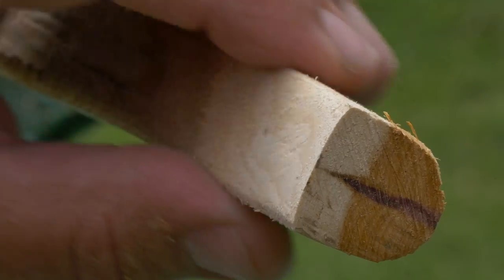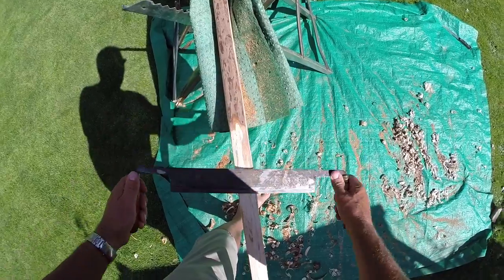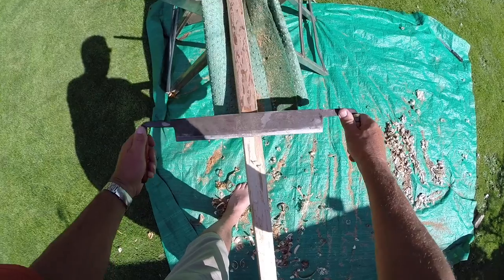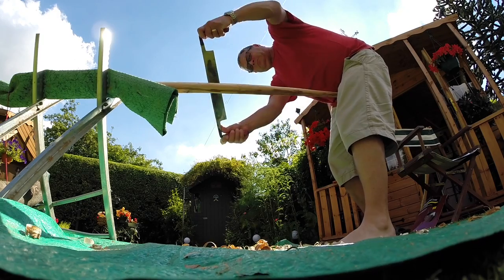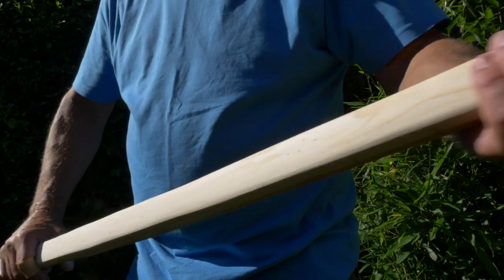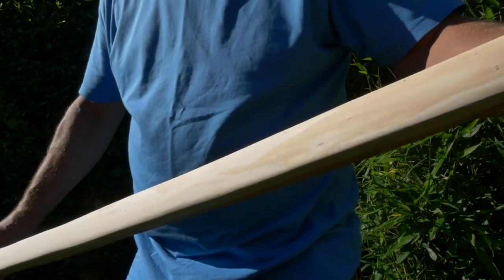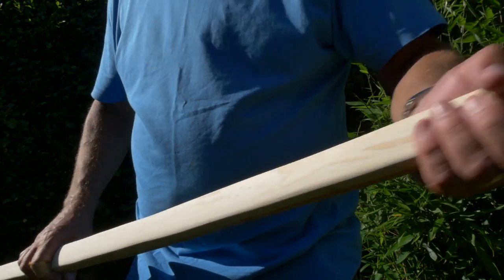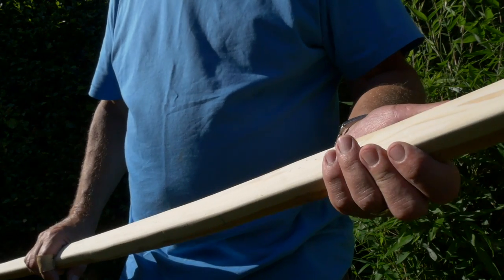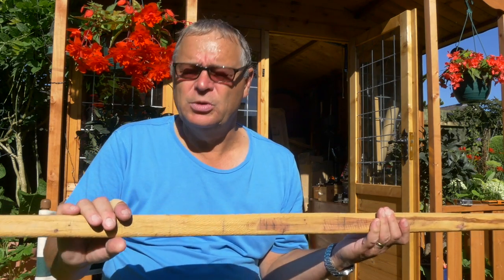From the basis of that, I started work on the entire bow — gingerly to start with at the tips with a spokeshave. Then, as I gained in confidence, I used a drawknife to work the entire length of the bow. I'll do some further work later on the back of the bow to try and remove some of the imperfections in the work I've done with the spokeshave and cabinet scraper. But for now I think that will do. The stave now has a much better proportion of sapwood to heartwood.